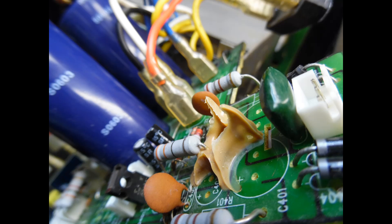The other problem is if the glue covers components like resistors or ceramic disc capacitors, it starts to corrode through them. So I've taken the time to remove the power supply board — which just has four fixing screws plus one through the bridge rectifier — and work on it separately on the bench. There is quite a lot of glue here, so I've had to desolder a number of components to get in there. There is still elasticity to this glue so it hasn't fully dried out, but I'm doing this to prevent any future issues for the customer.